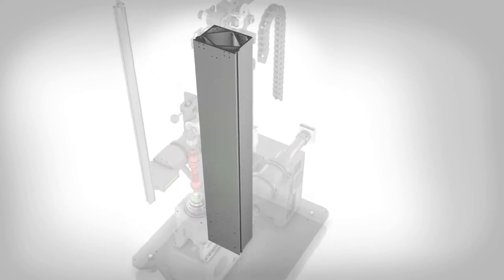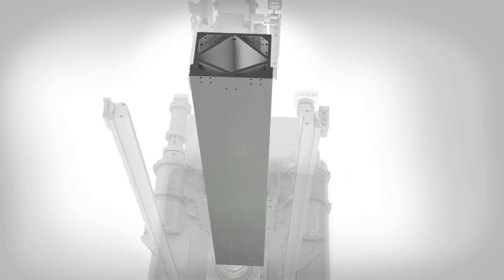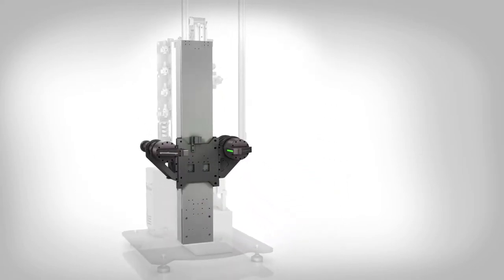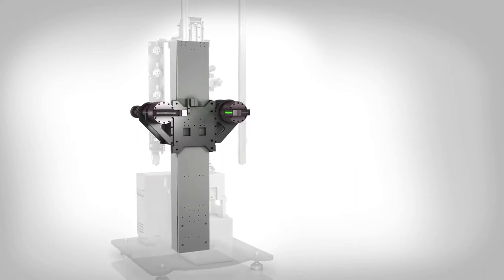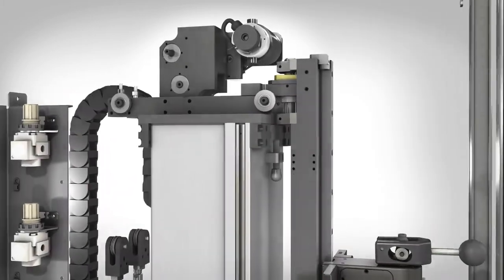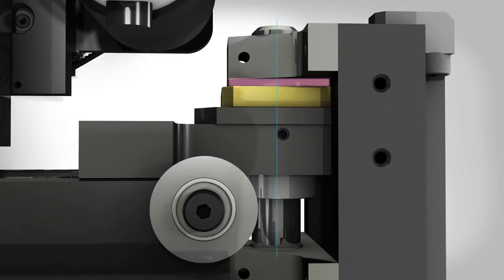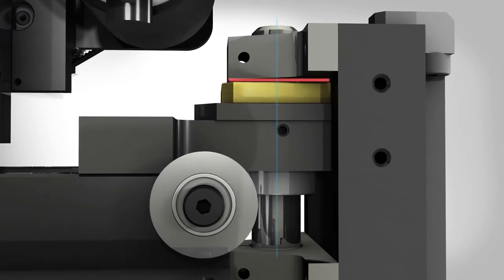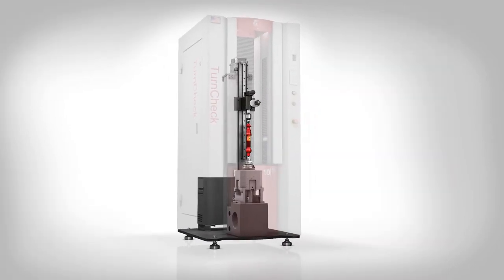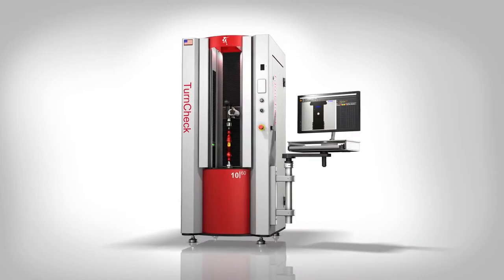The granite isolates vibration and provides a rigid base for the rotary axis. An extruded aluminum column with an internal lattice provides highly rigid support for the optical motion assembly. A patented bearing weight design isolates the optical motion from the effects of thermal expansion. The tailstock beam is constrained radially but remains compliant in the linear axis, decoupling the thermal expansion of the aluminum support column from the steel tailstock. Each carefully selected material is monitored and compensated to maintain thermal stability and long-term repeatability.